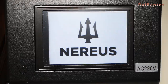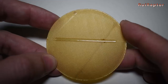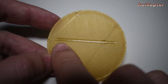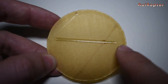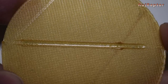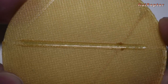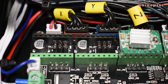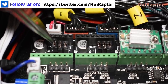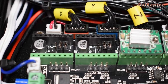The motor direction is the same as the TMCs. With 1x128 steps, we noticed an issue with the non-printing movements. The printer printed the base of the bottle just fine, but when it did the non-printing movement, it was like the microcontroller was having a hard time processing the information, and it moved so slowly that it caused a visible defect. We tried a couple of times with the same result, so we decided to stop the test at 1x128 steps.